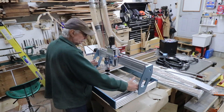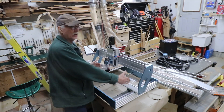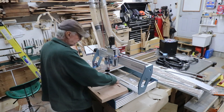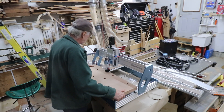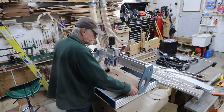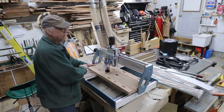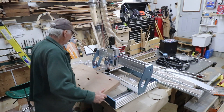Which is very cool. There are dust shields that go here and here, but it narrows the width of the working surface. In order to do the mortises and the through slot on the tables that we make for the looms, I have to go in between the gantry supports like this. All of these mortise and tenon joints are within the working surface in this dimension, so we can do those very nicely.